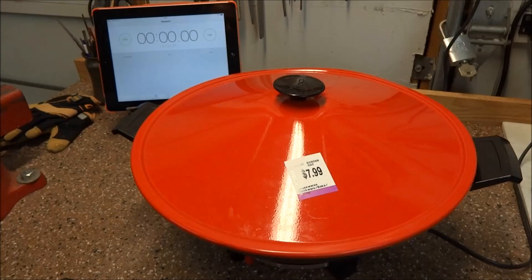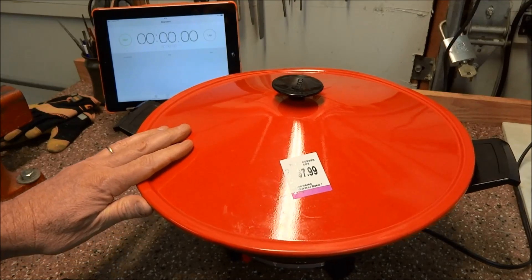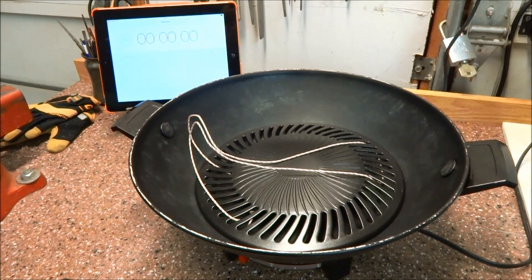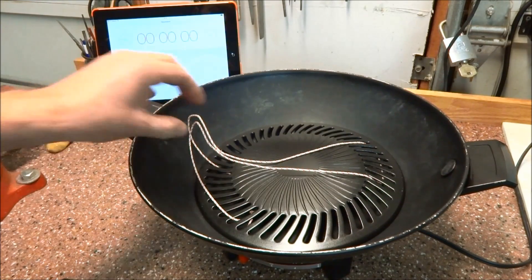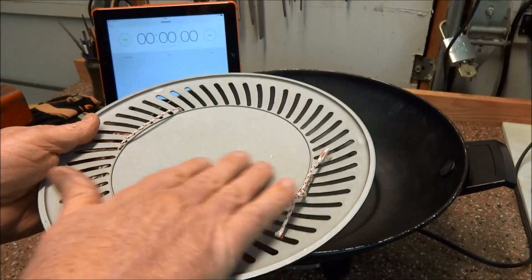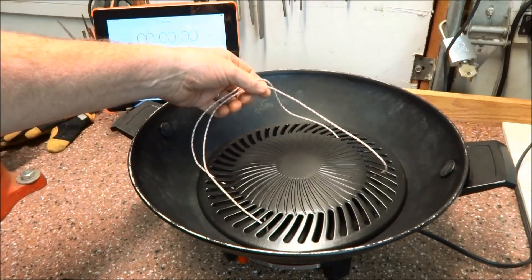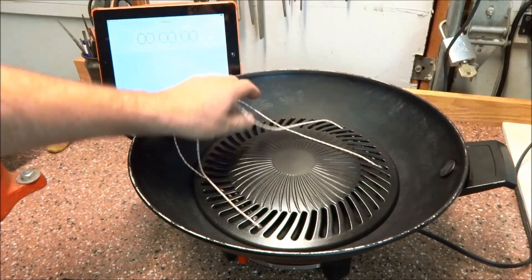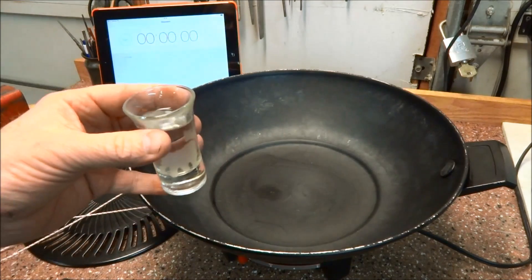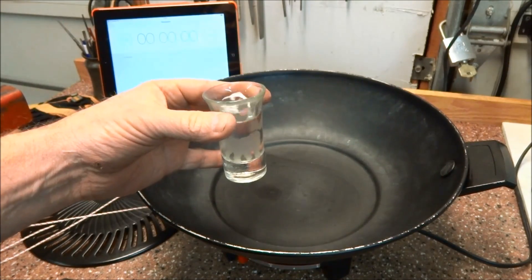Let's take a look at what we've come up with. After those two chuckleheads burned down their garage, I bought a wok — this one at Salvation Army for $7.99. We're not going to use the opaque top; you could use any kind of crock pot or electric frying pan, anything with a covered element and no open flames at all. Inside is the steamer tray, which I'm going to turn upside down so acetone doesn't condense in the low area at the bottom. It's covered with Teflon so parts won't stick, and a string lets me easily lift the part out. We need 20 to 25 cc's of acetone — acetone boils at 133 degrees, so we don't need a lot of heat.